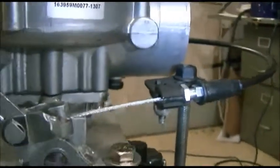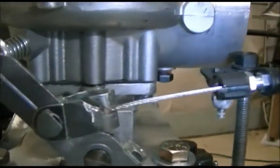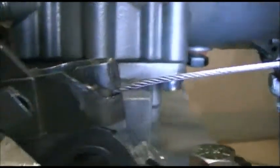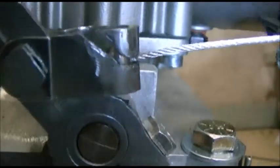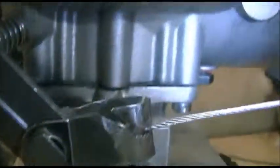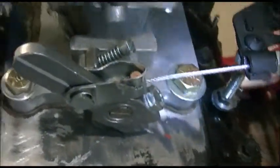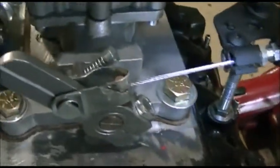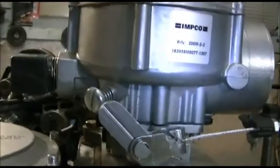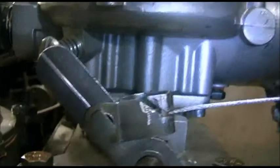My throttle linkage — I had quite a time figuring something out here, but what I've done is I've taken my little C-clip and cut a groove in it for the cable to fit in. There's a round brass end in there. My throttle gives me one and three-eighths inch throw, so that's where the hole had to be in the arm to make it work properly. It pulls really nice, nice and even.